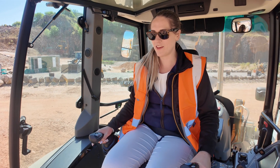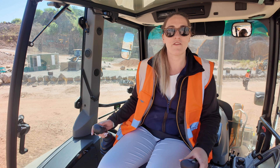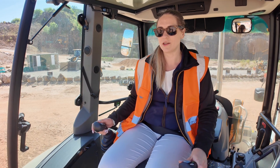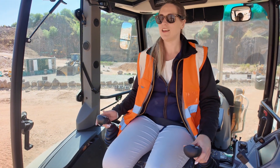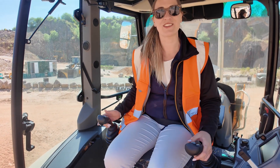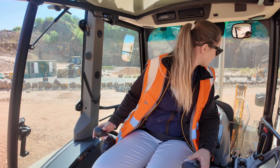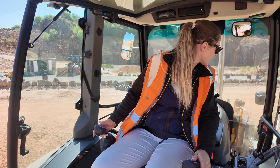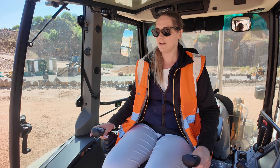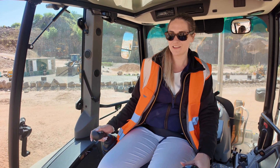So what I'm now able to do is lift myself up with the excavator end of the machine. If I was stuck in a boggy situation, I've lifted myself up and out, and whilst I roll forward with my front shovel, I can push away with my excavator end — and I walk my way out of a boggy situation. If I needed to go again I could reset, level that out, lift myself up, roll and push, and off we go.